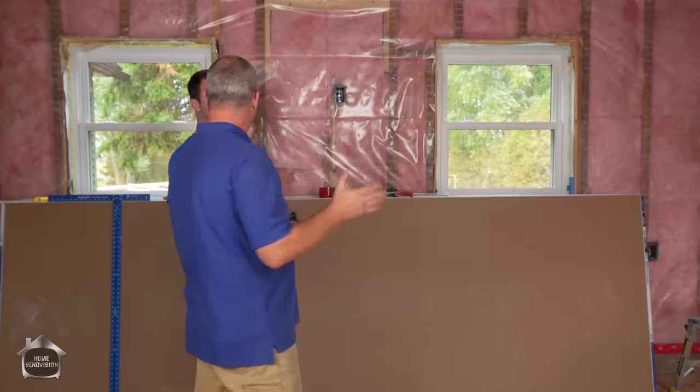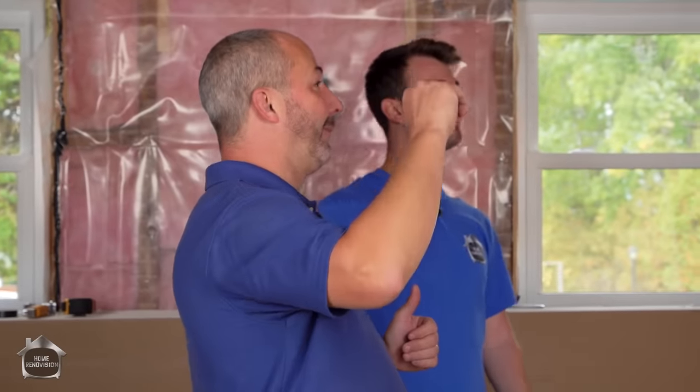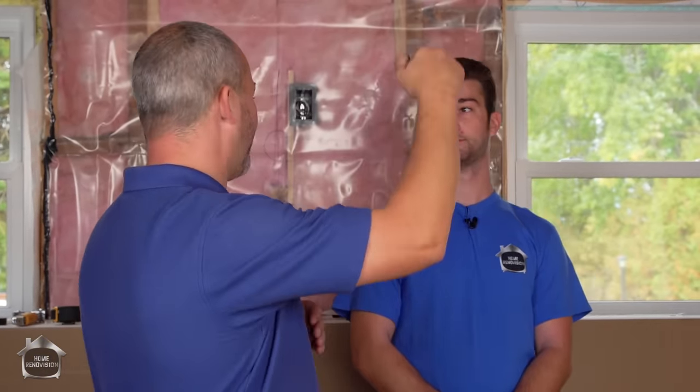First of all, nice, I'm pleased. Now, this project here is a little complicated because we've got, I don't know, 300 lights in the ceiling, right? We've got an 1880s, it's balloon frame construction, so we don't even have top plates everywhere. We don't have continuous vapor barrier. There's a lot of issues here. So our goal in this renovation is to get the house improved as far as the science of the construction, but not to go too crazy, right? Because we gotta find that sweet spot of making sense.